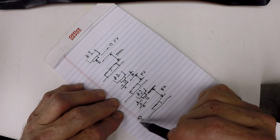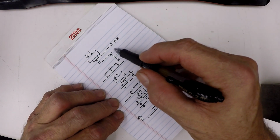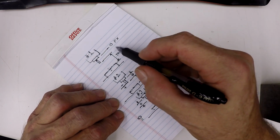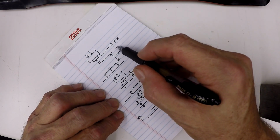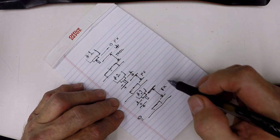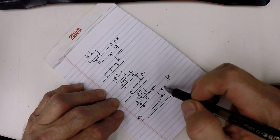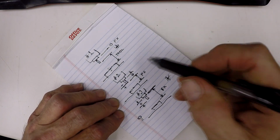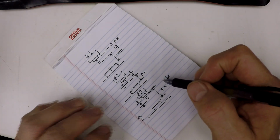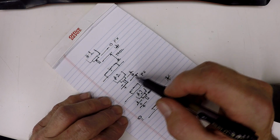So this method here is kind of the preferred method and most used, although I've seen people use all three of these methods, and they still do in the shop that I rent space in. They almost use this method all the time right here. Although I've been trying to get them over to this method number 3 because they bought a tool setter, and this is the best way to go. If you use a tool setter away from the machine, you could set all the offsets or print out a list of offsets, and they can input it into the control or download them to the control too.